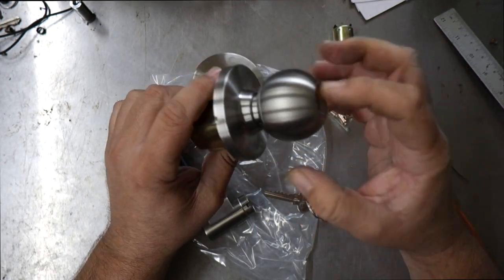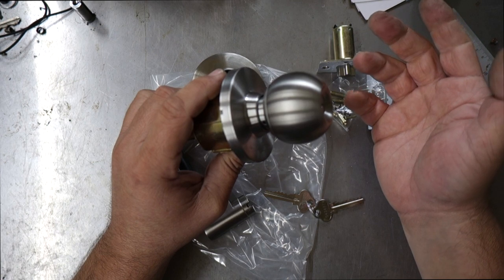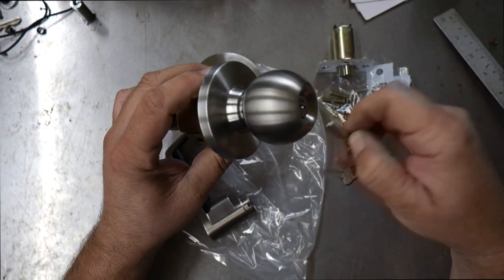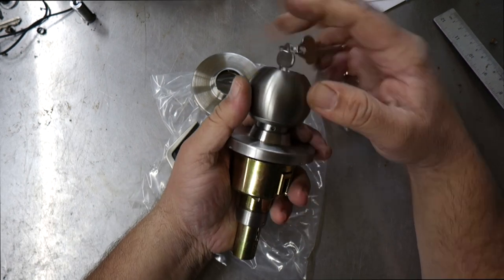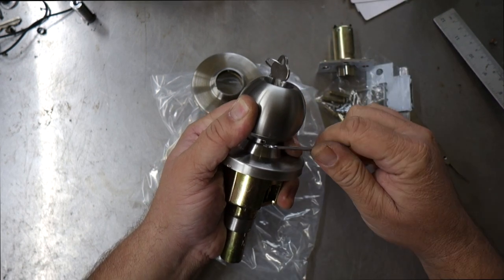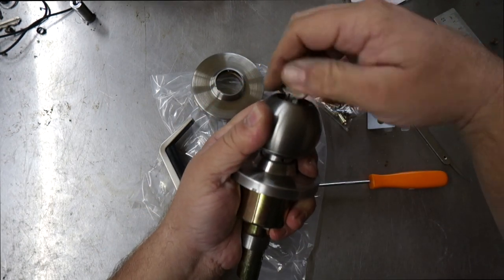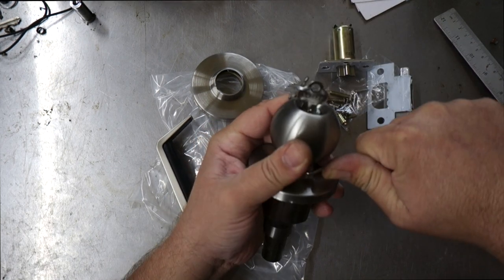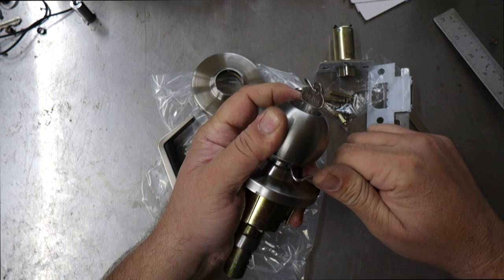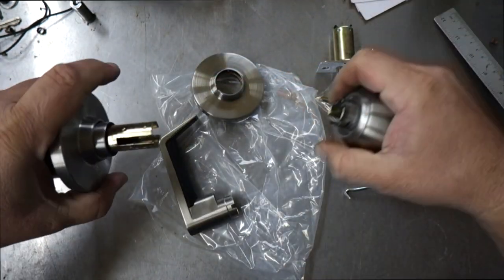On the front, there's a small hole to insert the key and remove the knob so you can change the cylinder — mainly relevant for the handing of the door. The keyhole on this cylinder is currently upside down, so I'll correct it. With the key inserted, I'm looking through the small window for the push-in point. They can be a little tight being commercial grade — it's starting to slide now, and there we go.